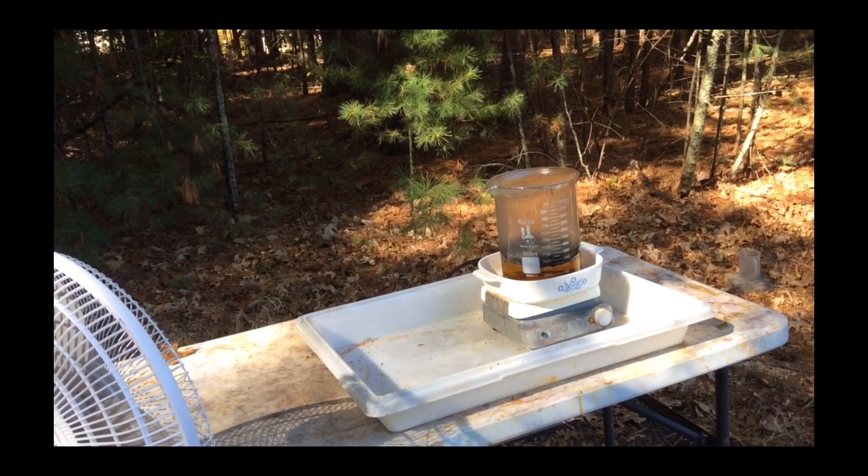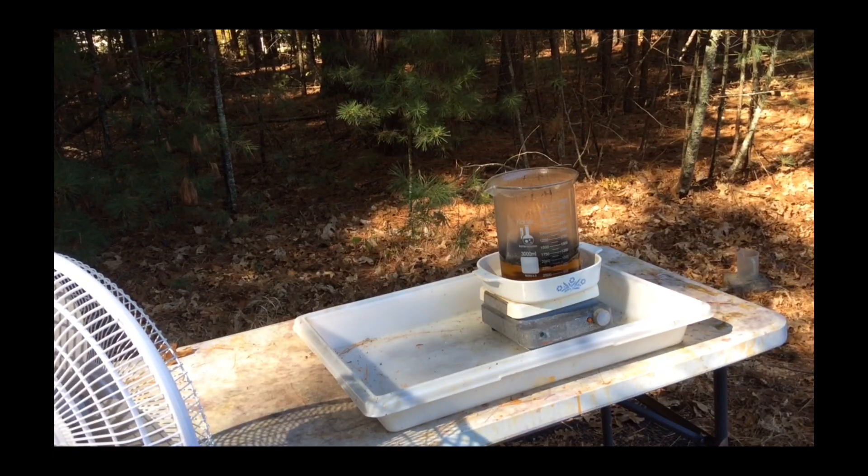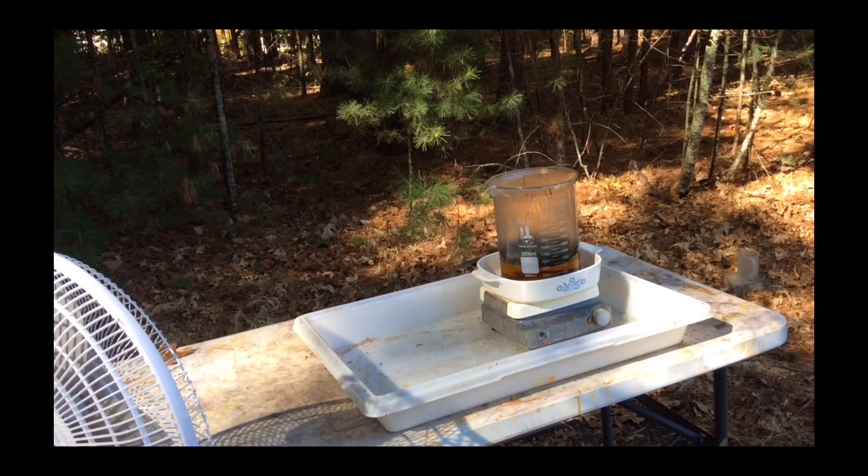I am going to add an eighth of a teaspoon at a time. If it reacts — and it can react violently if you add too much — that means I added too much nitric. If it doesn't react, that probably means either I still have undissolved gold or I hit the proportion just right. By the way, many refiners use urea at this stage to denox the aqua regia, but I was taught by the best and it is highly recommended to use sulfamic acid. It needs to be added slowly to warm aqua regia. Let's see what happens.